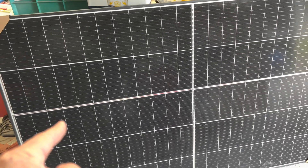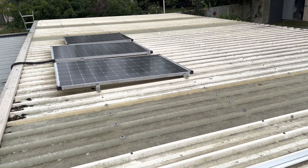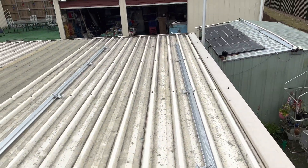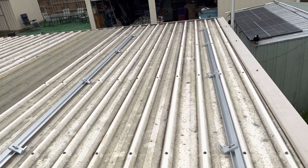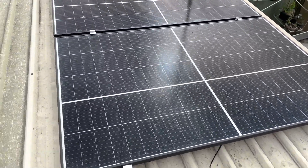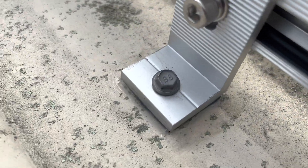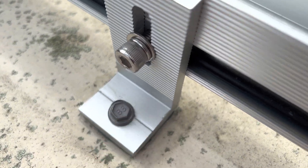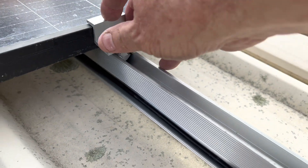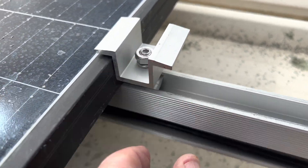So I'm on the back roof — that's my old solar setup there. My new panels are going to go along here. There's the rails. I simply bolt them down to the rafters and then use the clamps to clamp down the solar panels. I've only got three panels; this will take four. So the rails are down, I screwed them down — there's two panels. I screwed into the pole on the carport. There's a rubber at the bottom and I even put silicone so I don't get any leaks.